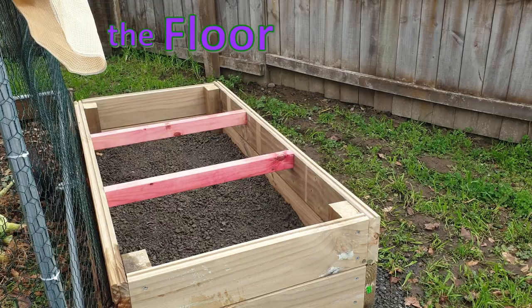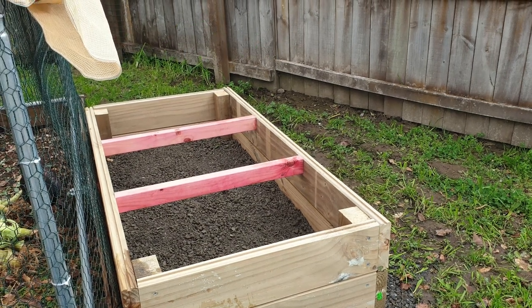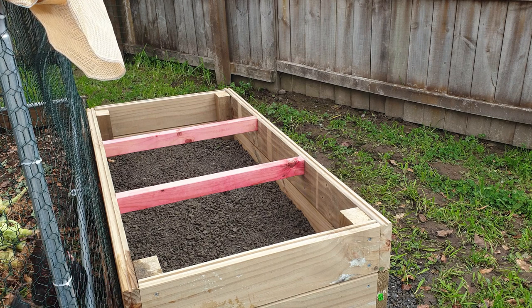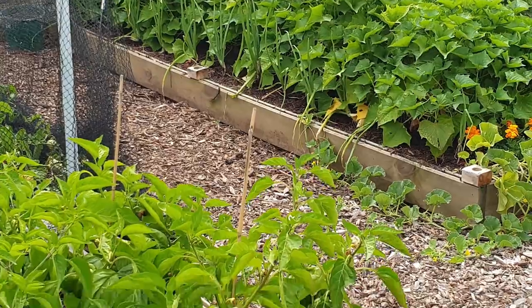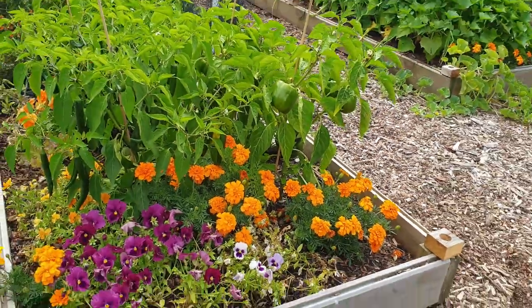The first step was to make the foundation for the floor. We knew we wanted the floor to be 1 metre by 1.8 metres, so we framed up a box of that size out of ground-treated timber sold for retaining walls. I've used a lot of this timber to make my low-raised garden beds, mostly because it's cheap and readily available. If you can say anything is readily available in these times of uncertain shipping.